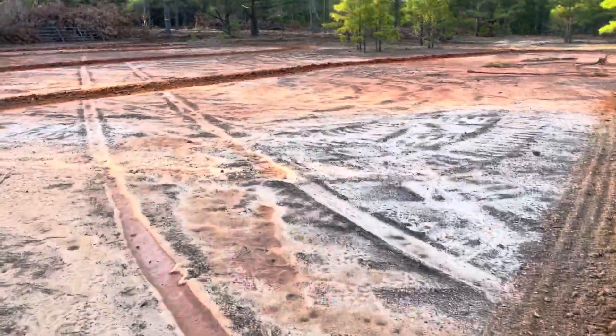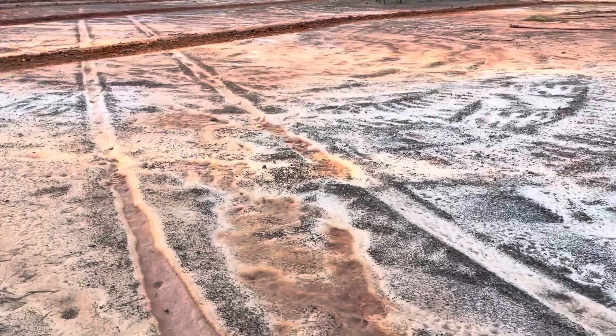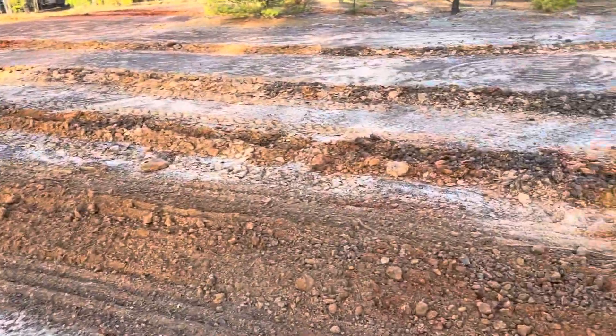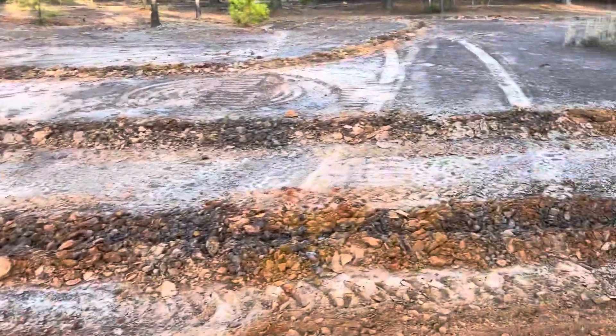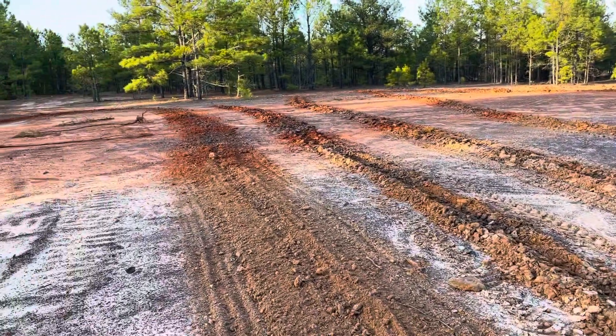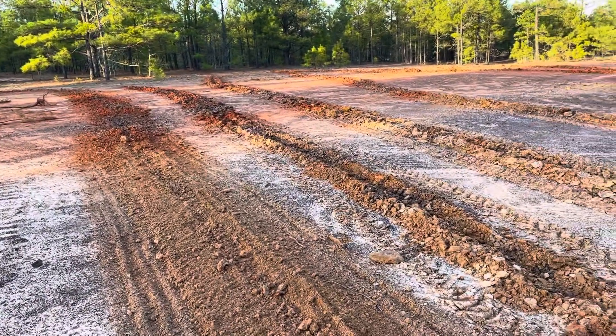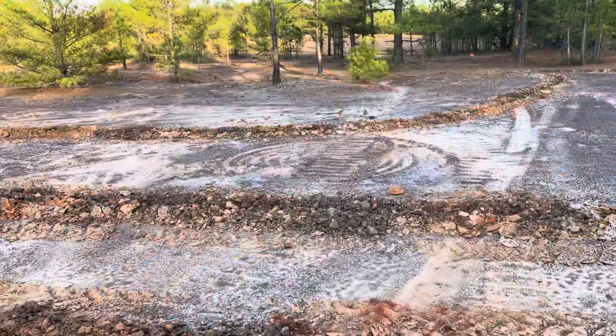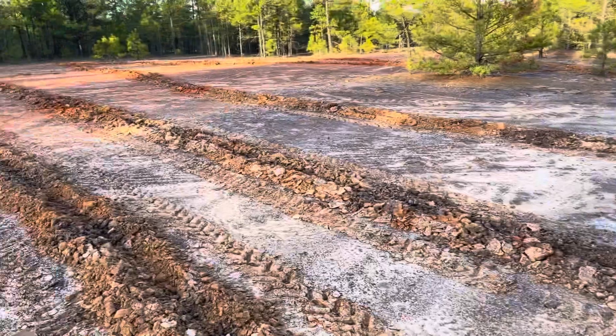As you can see, just based on the undisturbed areas, it's just a flat surface. A lot of sand and silt goes down a little ways, and then you get into decomposed shale and clay. The problem with that is it doesn't hold water — the water just kind of gets in, soaks down at least to the bottom of the clay or to the top of the clay zone, and then it just sheets on down through here.